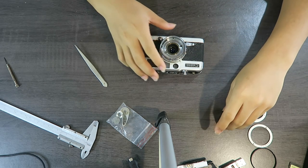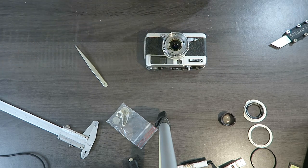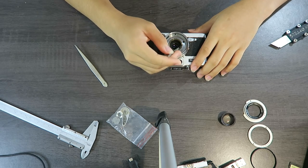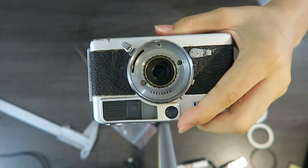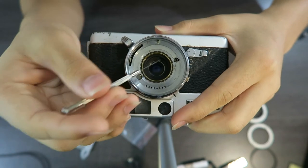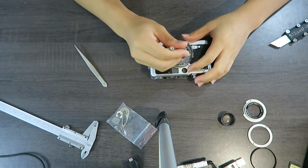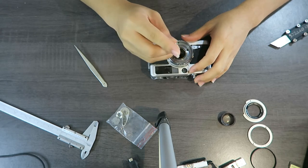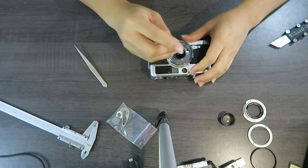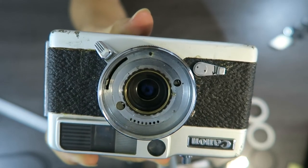You can see some gunk on here which is not supposed to be there, and you can see this locking ring style thing. This thing has a locking screw which locks this ring in place — unlike the Yashikas where they don't have this locking screw and you just spin the black ring out. On this camera you have to unscrew the locking screw first. Let's see — it goes out pretty easy. It's a rectangle shape, so you just unscrew it until it clears the gap.